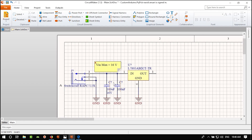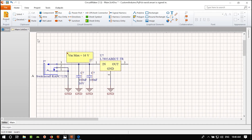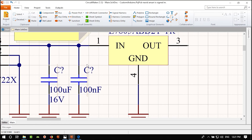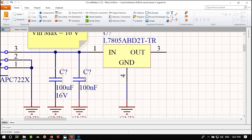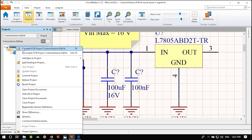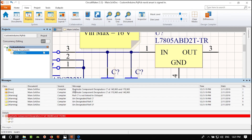If you zoom in you can see the USB-to-UART converter connects USB D+ and D- on one side, and gives TXD and RXD on the other. Let's do that. First we need a USB connector — go to Library and search for it. Let me detach the library panel.